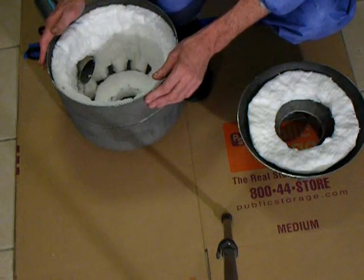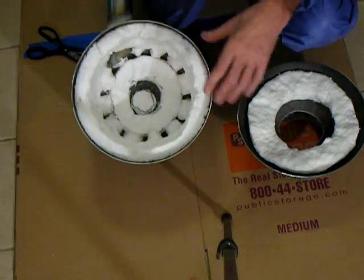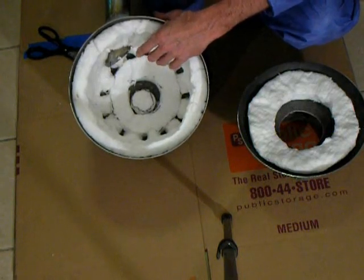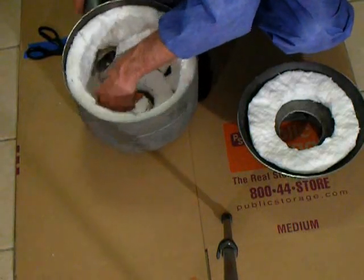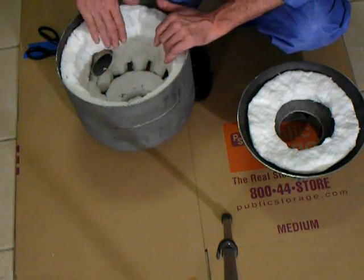This stuff can take the heat, so it doesn't need to be removed. The reason for the holes in the bottom is we're trying to create a bearing surface for the fire clay so it's not just resting against this wool. Even though this is a ramming type process where we'll be packing the fire clay in, we still want to maintain a good bearing on the surface on the bottom and also around the edges. So you want all your workable surface to be solid fire clay. Where the seam of the tank is, I have cut some slots in there so we get a center grab around the seam.